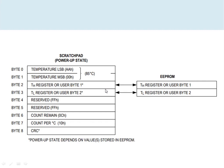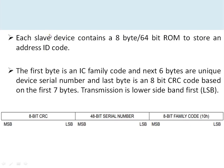The alarm setting can be set by the master, that is the microcontroller, and stored in the EEPROM, which is non-volatile memory. Byte 8 is the CRC, which provides error checking for the remaining bytes of the scratch pad. Each DS18S20 sensor has a 64-bit ROM to store a unique address ID code. The first 8 bits represent the family code — for DS18S20 it is 10H, and this changes for different sensor types. The 48-bit serial number is the unique identification for each sensor.